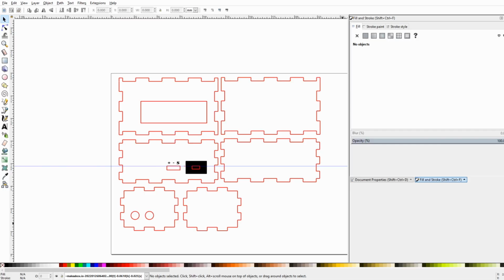So this is our box that we're going to put the thing in. I've taken the PDF and made the stroke all red so that it's a cutout command on the printer, and I've added a cutout for the screen and for the cables to go in and out. These are the main cables, this is the power cable, USB thing, and this is the signal cables for the thermometers. The reason the USB's got a black box around it is that the ply is too thick and the connection on the Arduino Nano isn't long enough to stick all the way through the ply, so by doing a raster engrave on the box, it will allow a thin section of ply to be around the hole, and it will allow us to plug in the power a lot easier.